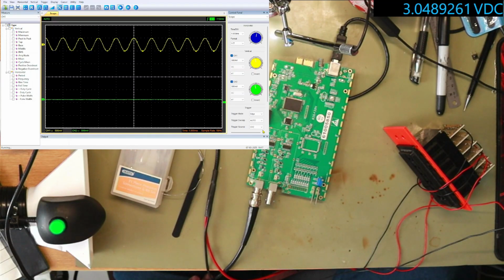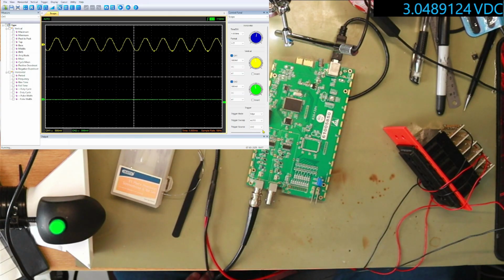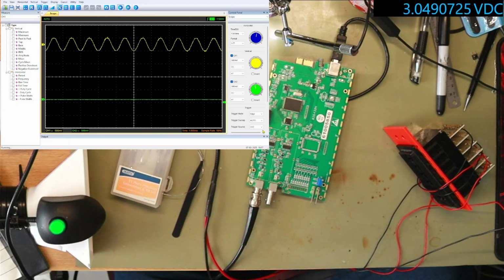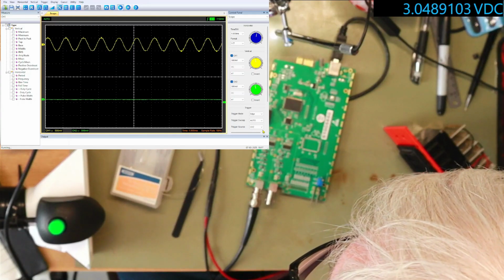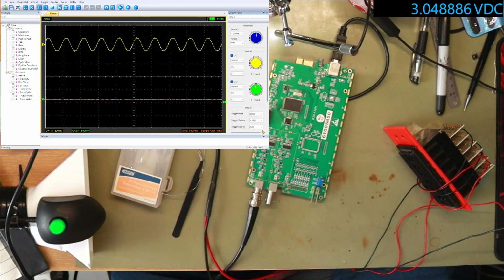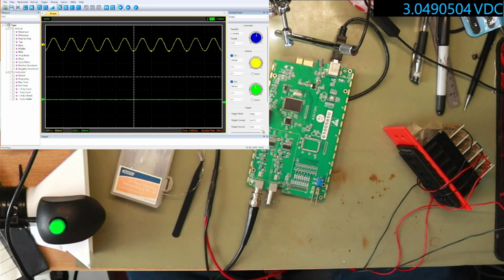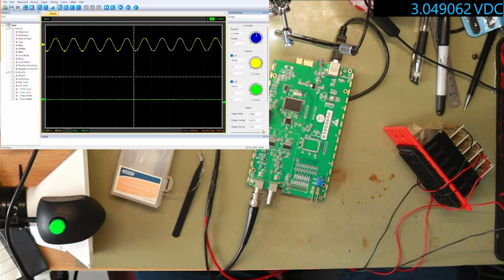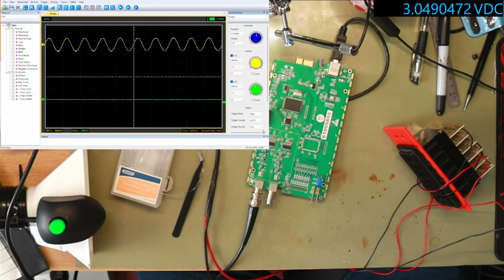So anyone out there who's got one of these, I recommend making it more useful for doing what you want to do, like just see a signal and you don't care if it's DC or AC coupled, or you could leave it like this: 1 AC coupled input, 1 DC coupled input. But I shall probably do the same mod to the other side, as it's very rare that I DC couple my scope, because normally I'm looking at AC signals that are biased with DC voltage, so you tend to be on the AC range anyway. I've probably upset the frequency response because of putting that there, but we can have a look at a scope input, and normally they're about 1 meg input, so we'll just see how it goes with a ×10.